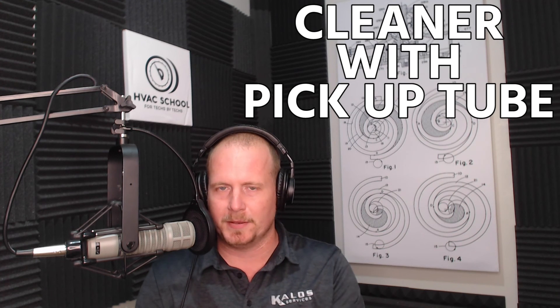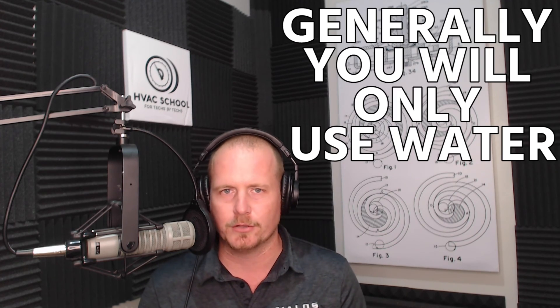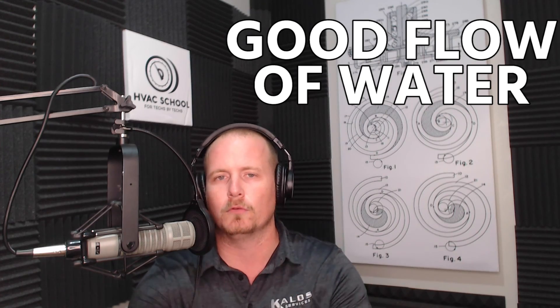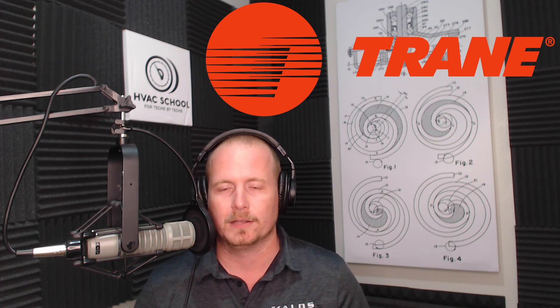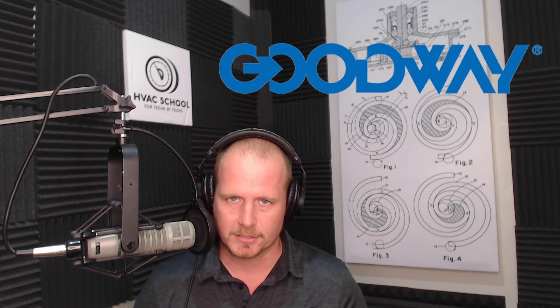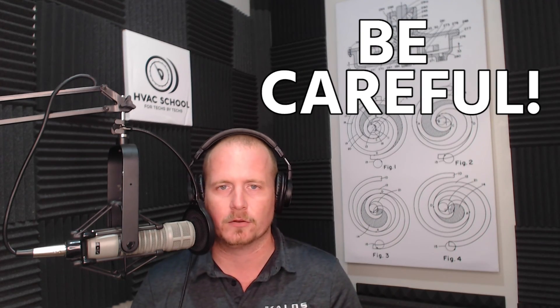You'll notice we are using a cleaner with the pickup tube on a microchannel coil. I know some of you have read certain manufacturers say you're not supposed to use coil cleaner on microchannel, and some will say use it only in extreme cases. We're doing it here because we're demonstrating it — we rinsed it really well and it's not a harsh chemical. This is for demonstration purposes. Generally on microchannel, you're just going to use water. In fact, the Coil Pro is a great tool for that, because with the 90-degree tip and good water flow, you can get a good clean even without using a cleaner. Trane even recommends the use of the 90-degree tip in their literature, specifically from Goodway, to be used with this tool. Only ever use coil cleaner when it's needed, and especially on microchannel, be very, very careful.